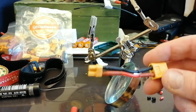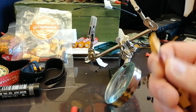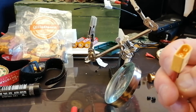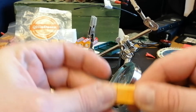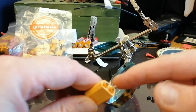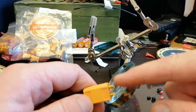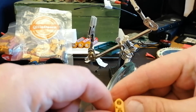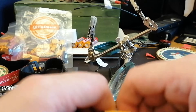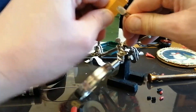Now what I do is use this piece of wire — it's not the extension we're making, but it's got the XT30 on one end and an XT60 on the other. When you're soldering, put these two connectors together like that, so when you heat up one end it doesn't disfigure the pins on the other side. If you don't do that and just heat it alone, the pins get bent and out of shape and you struggle to get the connectors together.